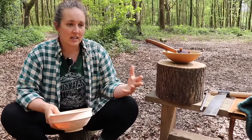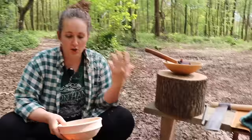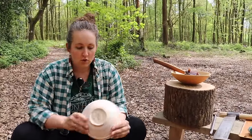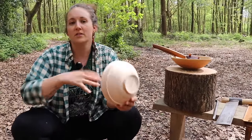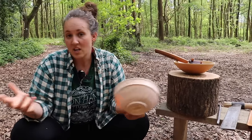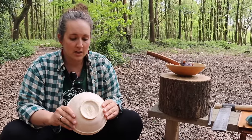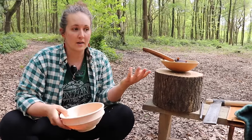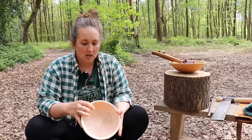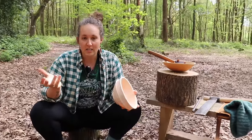I tend to lean towards the camp of oils that will harden as they cure. Now, to properly cure, something on a shelf is going to take even weeks, potentially months, depending on the oil. If your piece is really dry and you oil it with tung oil, I know some people who have built some really simple kilns, like a box with a light in it, and overnight it seals.